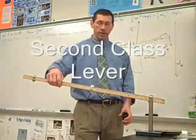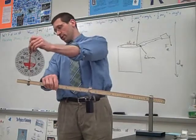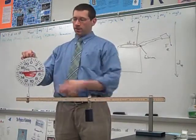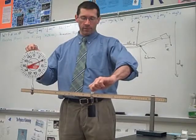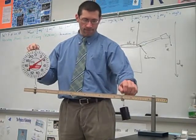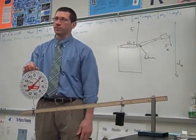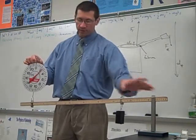Now with my fulcrum on one end, I'll put the load in the middle between the fulcrum and the effort, and the effort is over here at the far end. Should the scale read more or less than 9.8? Less — because there's a bigger distance on the effort side than on the resistance side. If I move my load in even closer, it reads less than 3. There's a large IMA here because the effort arm is much longer than the resistance arm.